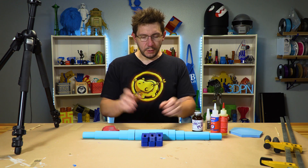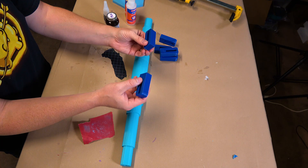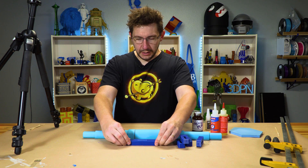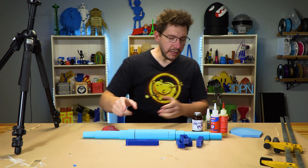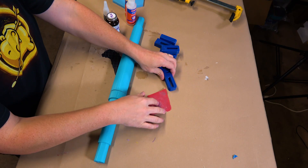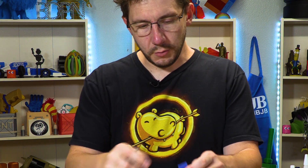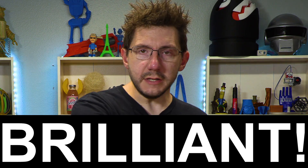Here's what we're gonna do. I want to put these together with the various attachment methods. These are just things I designed in Fusion 360 — the idea is they can attach just like that. I want to attach things right here and then once they're glued and adhered or cured, we're going to test them. I will put my life on the line for this — or at least my body parts, possibly broken bones. What we need to do is prepare these with some 220 grit sandpaper and a little burr remover to remove any elephant foot parts. Everything is ready.